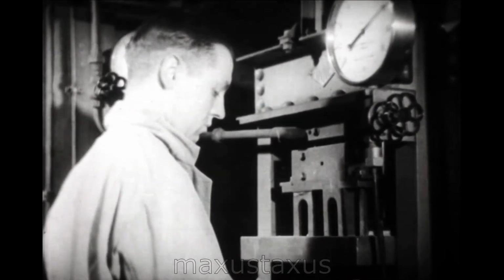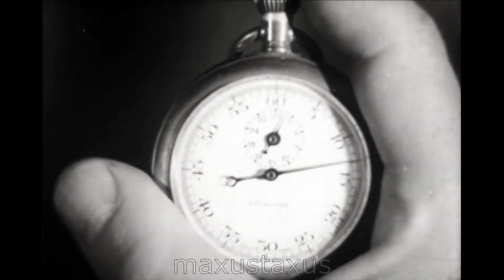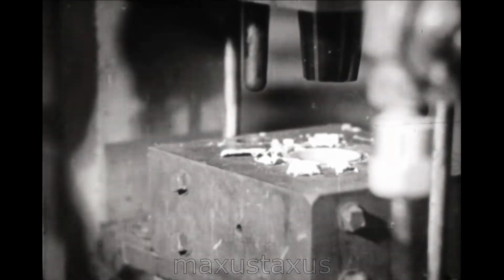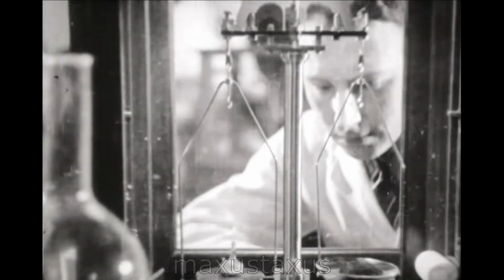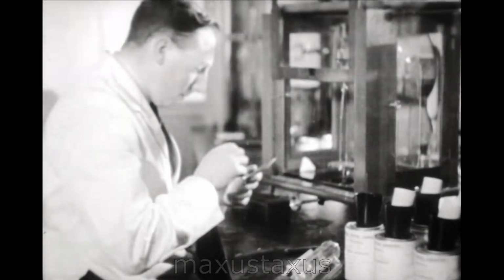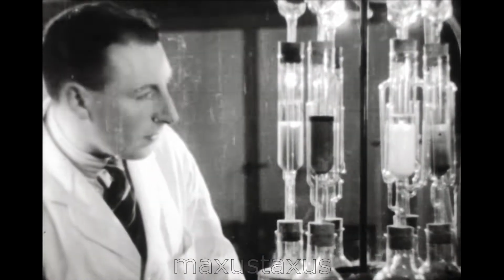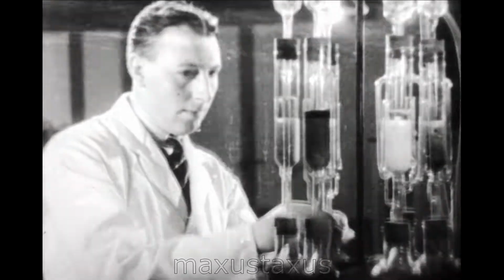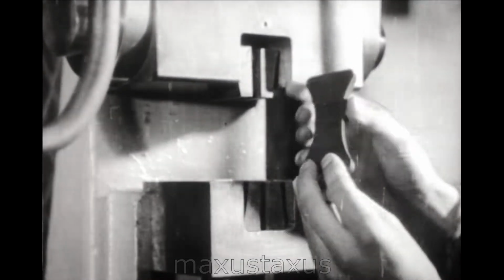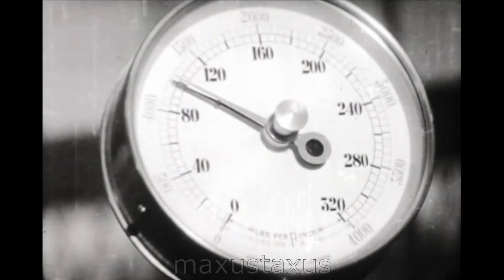These standards are maintained by certain tests, one of which is the cup flow test, approved by the British Plastics Federation. Another test by which the amount of resinoid contained in the moulding powder is ascertained. This test is also used to ascertain the state of cure of finished moulding. Tensile strength and good dielectric properties are other important factors in Bakelite moulding material, which are established by tests.